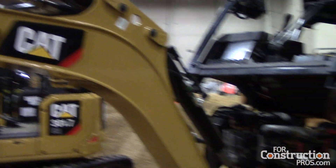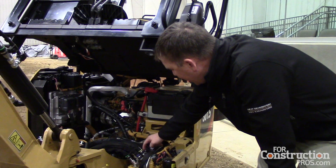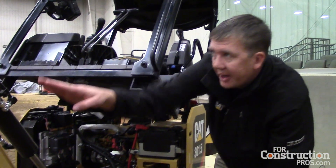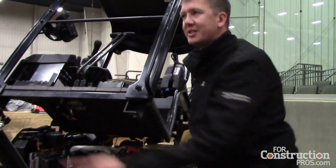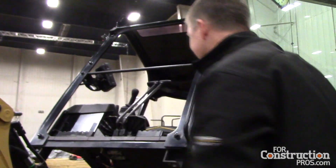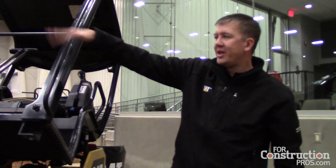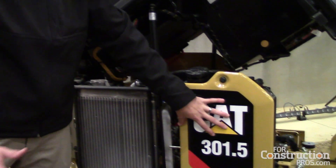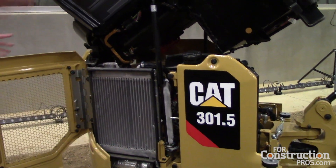They're all color-coded as well, so you know which hose is which if you have an issue and need to replace a hose. You see yellows up there, yellows right here — so you can see this hose goes right here. Little touches and details like that. Also, if you had a fleet of machines, they're all going to be laid out the same underneath. The fuel tank is covered, the hydraulic tank is covered — everything is all the way around it. So obviously, serviceability is huge.